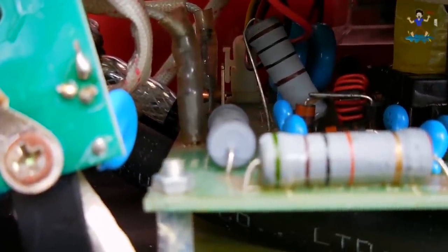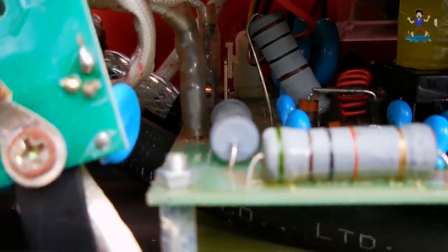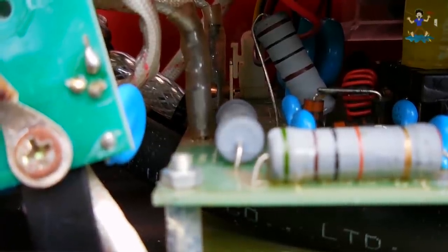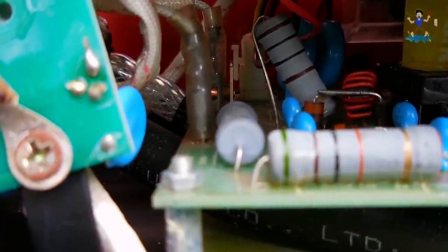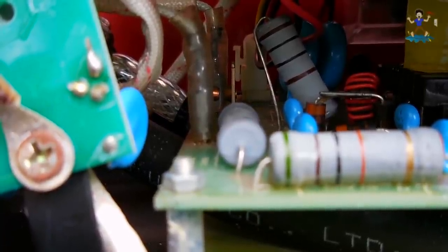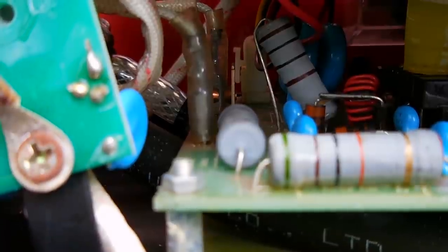All is looking well, so that means I should have a plasma cutter that's working again. Some of these units — if you go to use them and it does not start up — you have to make sure the contacts are clean. Take a small piece of very fine sandpaper, fold it in half like 400 or 600 grit, just clean those contacts. You want to leave a space probably of a couple of millimeters between those contacts. If the contacts are too close together the gun will not start up. Let's give it a try and see if it cuts through some metal.